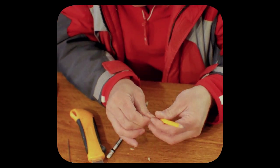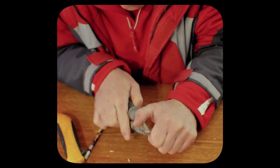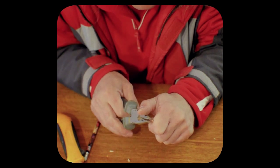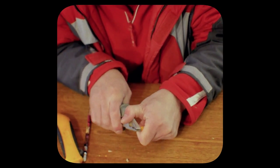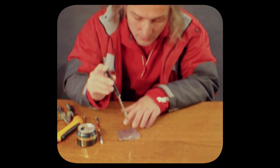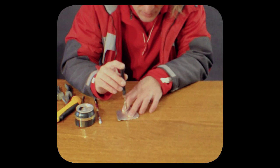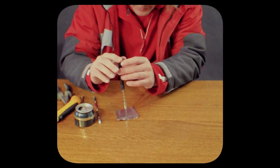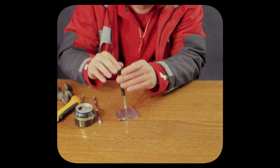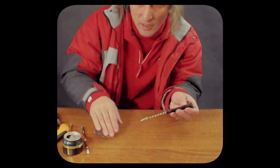If you can't find the drill, you can use a wooden pencil — put the needle into its blunt end, inserting the broken part of the needle into it. So we have the simplest hand drill. The diameter of the hole depends on the size of the needle and on the hardness of the surface where we are drilling. As the pointed end of the needle is conical, the diameter depends on how deep the needle goes into the tin sheet.